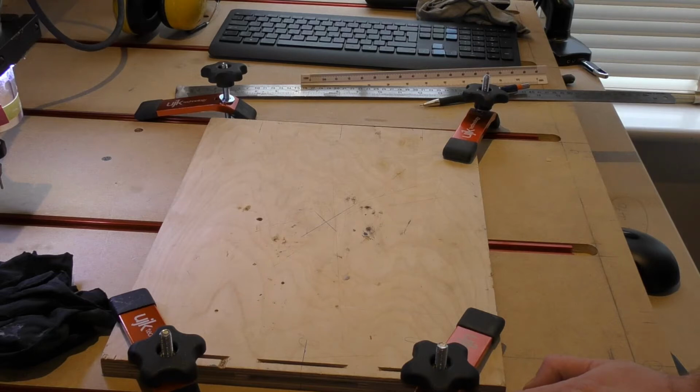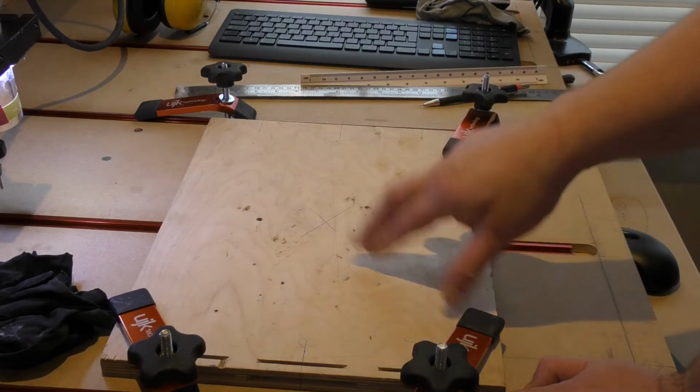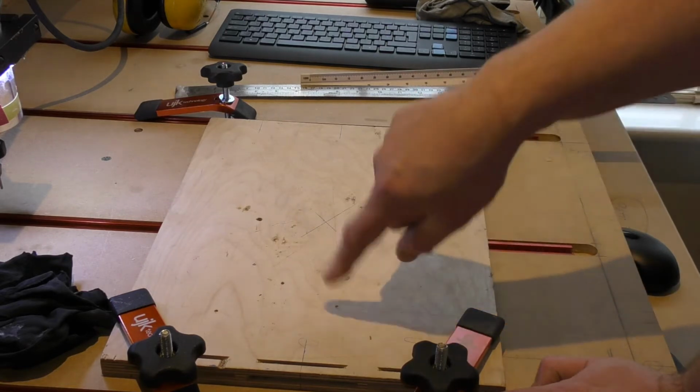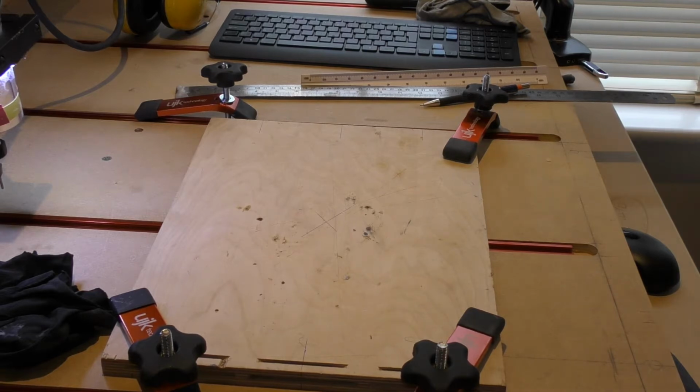basically on the breakout board on this system, you need to start Mach 3 first. I don't know why, because I didn't make the controller. If you start the controller first, then start Mach 3, it will come up USB device not recognised. After a lot of practice and trial and error, I've discovered over a period of time that it always works if you start Mach 3 first. So you start Mach 3 first on your computer, and then you switch on the controller to the CNC.